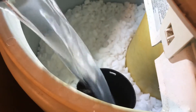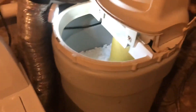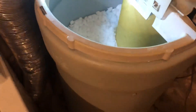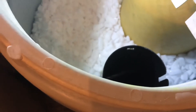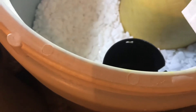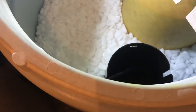You'll want to do this two-handed to avoid spills. If some gets on the salt, don't worry about it — it doesn't hurt anything. So we have our chemical in. Now comes one of the most important steps. We're going to put the lid back on our brine tank.